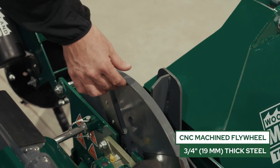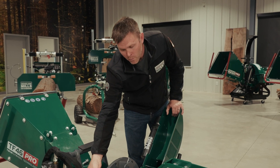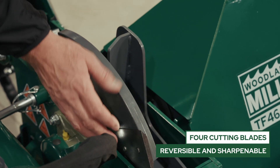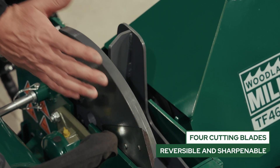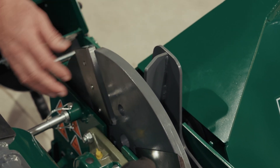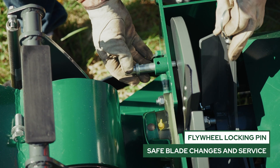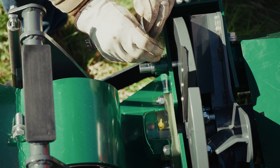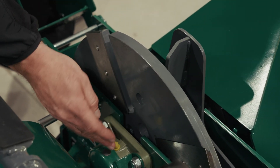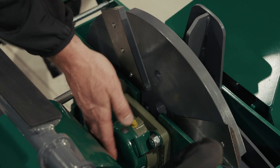For the primary flywheel, we use three-quarter inch thick steel that's CNC machined and pocketed, and you'll see we have four blades mounted. They're mounted into a pocket to protect the secondary edge because these blades are reversible, but also for reinforcement and support. When changing the blades and servicing the chipper, we have a lockout pin that's stored right here — it can be inserted through a hole in the flywheel to lock it in place while you're changing blades or doing any service inside. On the back, the primary shaft comes through and is carried on a four-bolt flange bearing with a zerk fitting for grease to keep it maintained.